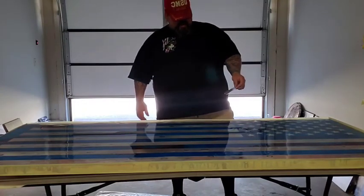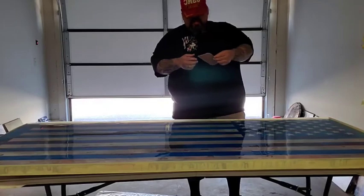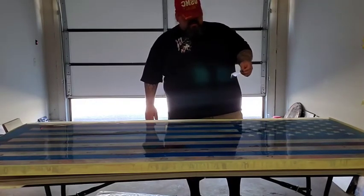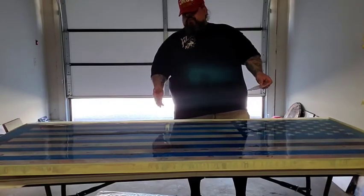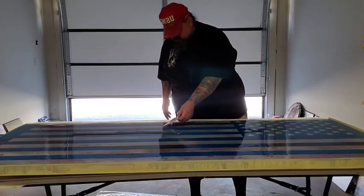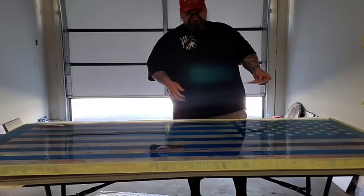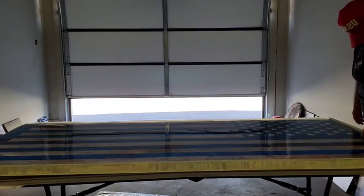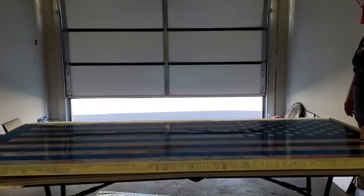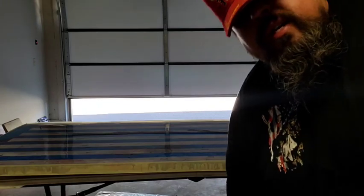See, I got some more paint in here. I'm just gonna see if I take that, picked it right out. Not a big problem. Sometimes you'll see some bubbles in this. You just take your thing and hit them, and they'll go down. I will hit this with a little bit of denatured alcohol to help pop some of these other bubbles that I can't really see or get to. I'm going to finish spreading this out and wait to see my final.